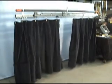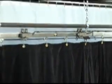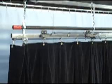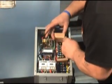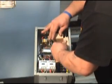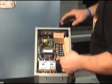Operate the system several times and make sure the limit switches are shutting off the machine and that the curtain is not becoming jammed at the end of its travel. Shut off and lock out the power source to the machine, then replace and secure the isolation barrier to the terminal strip. This barrier isolates the low voltage side of the terminal strip from the high voltage side, and is required for the machine to remain in compliance with UL and ETL standards.